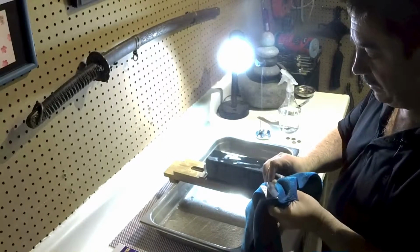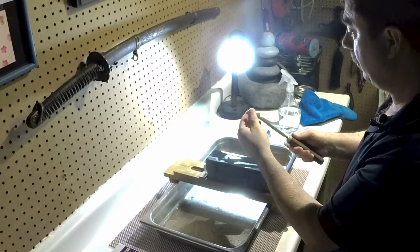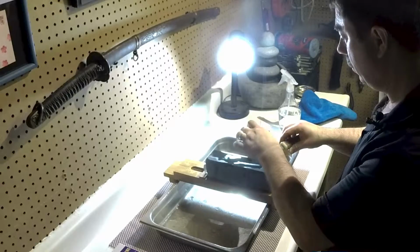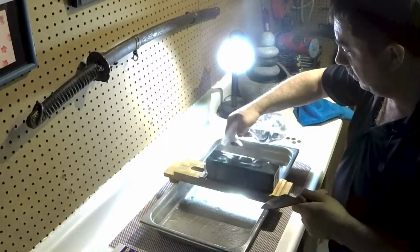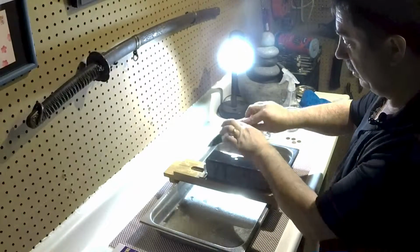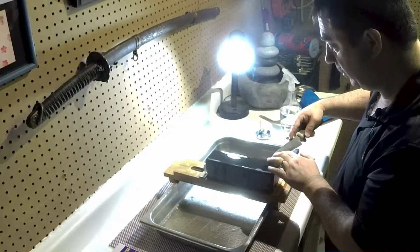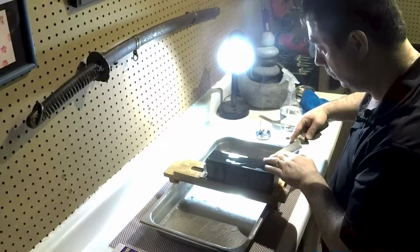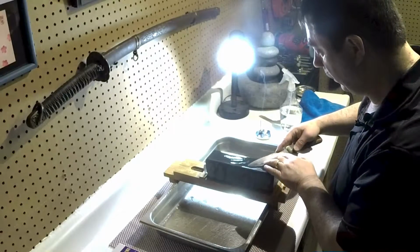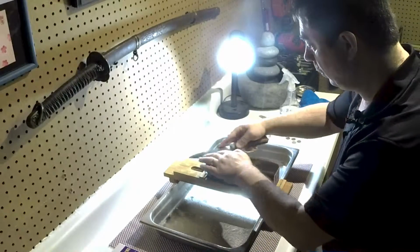This knife couldn't cut even a piece of paper when I first got it. Right, didn't take long to get the burr up. Now, what you want to do now, because you're doing it this way so the burr's on this side, right? So you want to do trailing edges, nice, easy. Very light, just the lightness of the knife. That's all I'm doing, just to take away the burr.